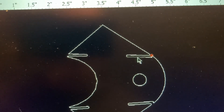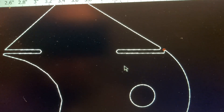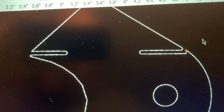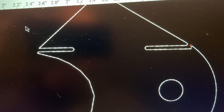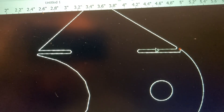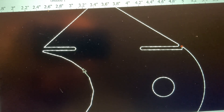The main thing I wanted to show is these slits. I'm bending these in the press brake, so I don't need the slits to make the bend easier or anything. But the slit is there because the way these edges taper away from the bend — if these slits weren't here and you were to bend this in the press brake, the lower die would be bearing here and about here. So this angled-away material is really not supported. Without these slits, you would get a weird ugly kind of curled edge here and here. Maybe I'll bend a piece of scrap to try to show that when I do this.